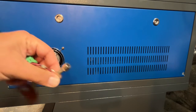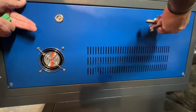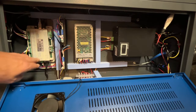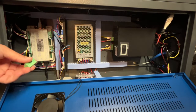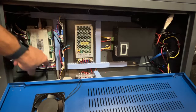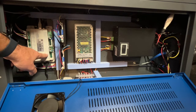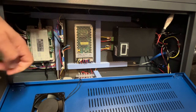In this particular laser, a small triangle-shaped key opens up this panel — it can be the same or different on your laser, most of these lasers are similar but do vary a little. Inside this panel is the controller, where we're going to be making our electrical connections for the electronic actuator. One of the parts we ordered from Amazon are these little green plugs. From the factory these are actually empty — there's no plugs in there, so you buy these and they plug right in. The two connections we'll be making are one for 24-volt positive, and the negative is the one that says wind, which is directly correlated to the air assist portion of your LightBurn software.